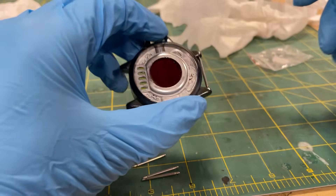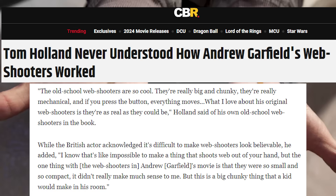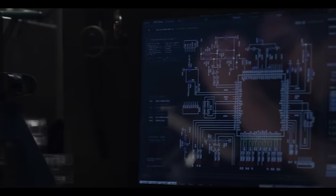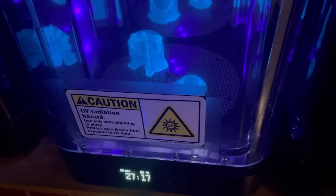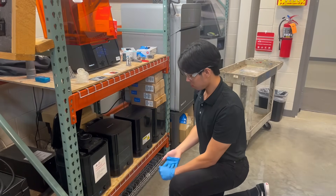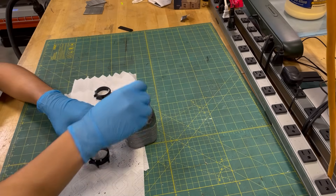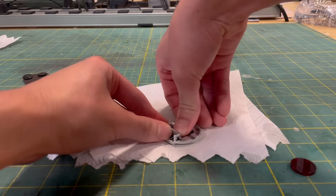For the housing itself, I decided to base my design on the web shooters from the Amazing Spider-Man film. It may not be the easiest design to adapt — even Tom Holland doesn't think it makes sense how ridiculously compact these things are — but I just love the design. I love the red LED glow every time he fires them, and something about the idea that Peter made his first web shooters from old watches is just so sick. I'm not going to be using real watches because they're too short. Instead, I used a resin SLA 3D printer to get my cases done. I actually had to redesign this part several times — some of the reasons were practical, and some of it was just my perfectionist nature kicking in. I didn't like the finish; it made it look more like a cheap plastic toy. Luckily, I found a method using graphite powder and it looked infinitely better. For the casing cover, I hid it with some black paint and then some silver leaf rub and buff. I also cut out some red and green acrylic pieces to go over the LEDs.